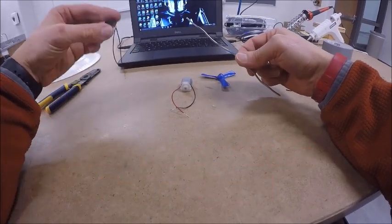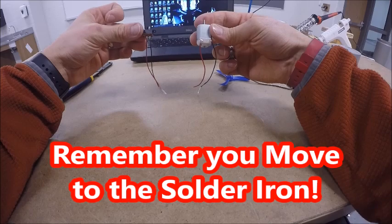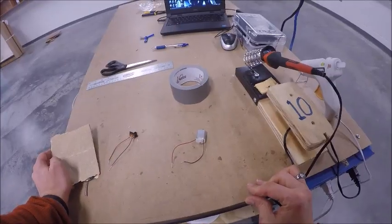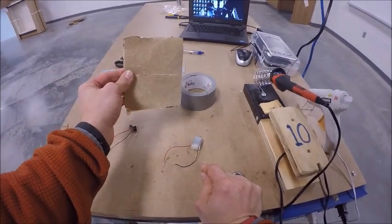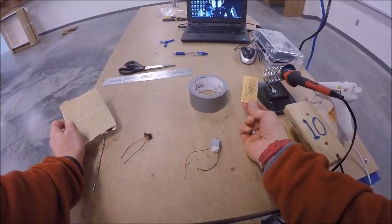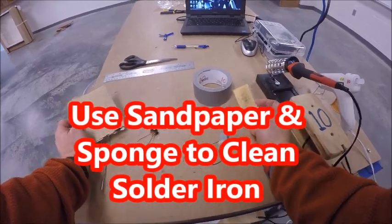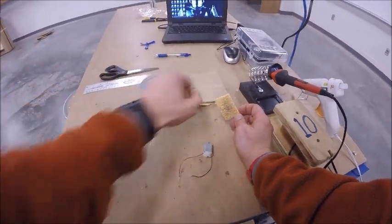Take your switch and motor and move over to the soldering iron — we go to it, we don't bring it to us. Before soldering, you may need to clean the soldering iron tip, which can get corroded with flux. You can use the sponge on the iron to clean it, or sandpaper if needed. If the sponge needs to be used, it must be wet first.